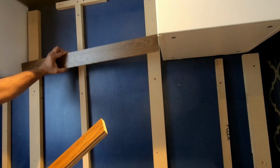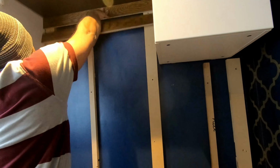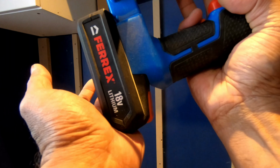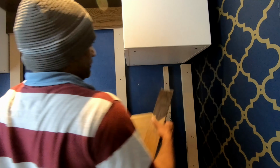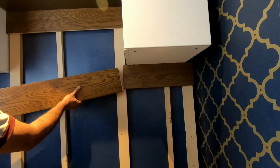Take your time to align the boards that makes the most aesthetic sense. This is one of the reasons why I removed the tongue from all the flooring boards. Now at this section nearer to the wall, I left a space of around 15mm. For this, I used a spacer to achieve this.